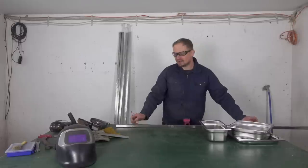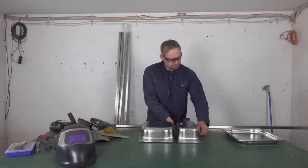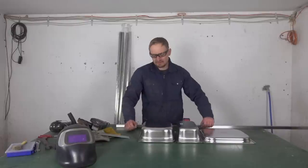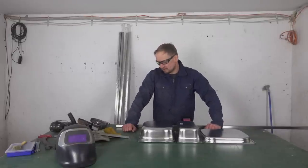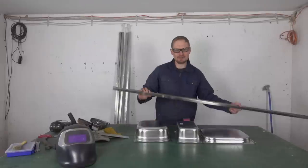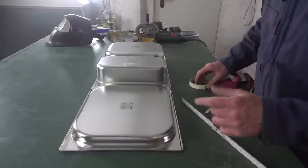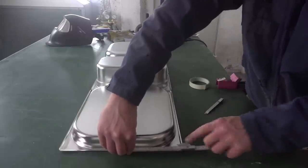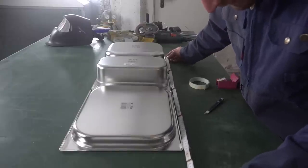The first thing I'll do is weld a kind of frame where these trays fit in. I place all three trays together, measure the inner width around these trays, and I cut four pieces with a 45-degree angle on the edges. Then I weld all four pieces together and I have a frame where I can put in these trays. I marked the inner width with some tape and used a ruler to measure it on two points — it's 77 centimeters.